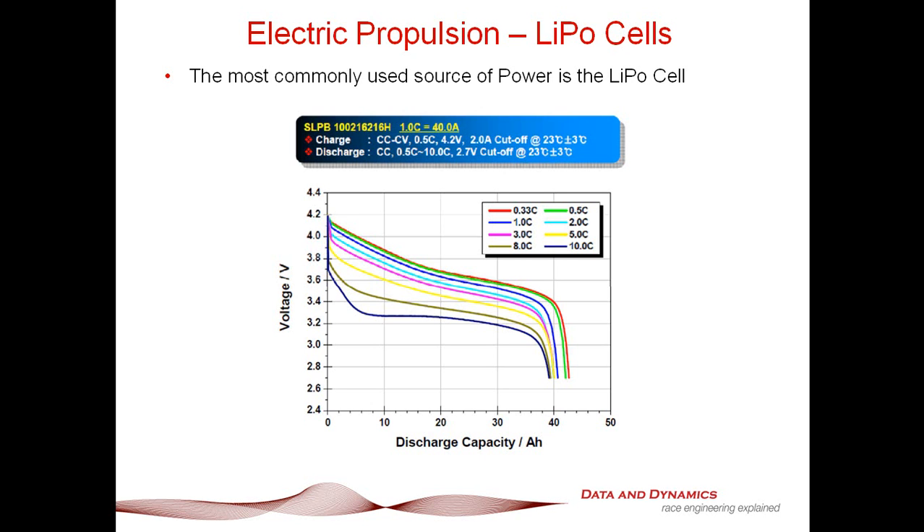Here's how to read one of these curves: what you want is that the perfect LiPo cell has your initial kick around about 4 to 4.2 volts per cell. In a perfect world, there's a little bit of a drop-off, but then it stays absolutely dead flat until you get to about 80 to 85 percent. Then it starts to drop off. That is the perfect LiPo cell.